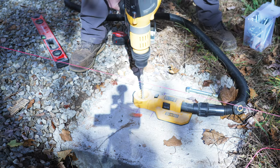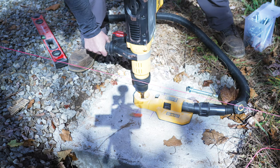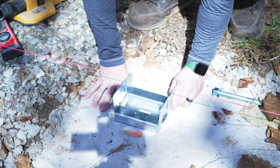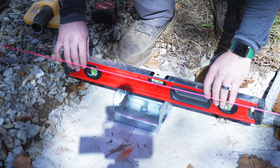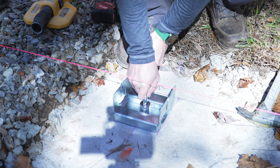I used a cool dust collection attachment to help remove the dust created by drilling — concrete dust is incredibly bad for you and I'd definitely recommend some kind of dust collection or respirator when drilling into it. The dust collection kit also came with an attachment for vacuuming out the hole itself, which was handy. Once that was done, I set the bracket in place, pounded in the anchor bolt, and realigned the bracket with my layout lines before checking for level. Thankfully my footings were all pretty level, so I tightened down the anchor bolt and called the first bracket done.